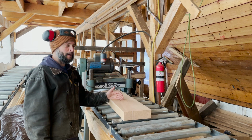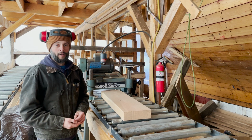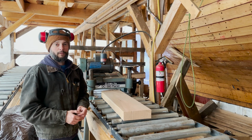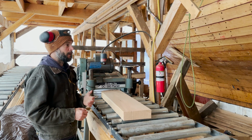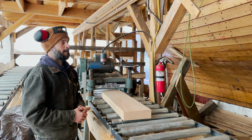one outside. And that's one of the challenges with harvesting our own timber, is we start with these big rough cut boards, where if you're buying things from the mill, they would rough cut them, and then they would dry them, and then they would run them through a planer, and they would send you very close to what you wanted. So if you were ordering planking stock, you know, you would get the boards, our finish is 1 1/4, so maybe you would say 1.5 inch thick planking stock, clear, these are the widths, these are the lengths, these are the price. And then you'd get that lumber.